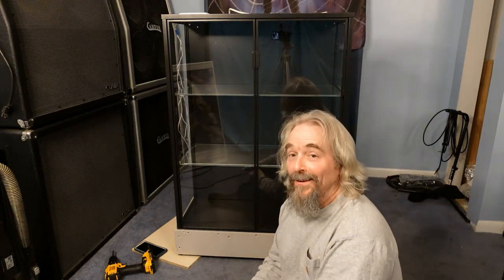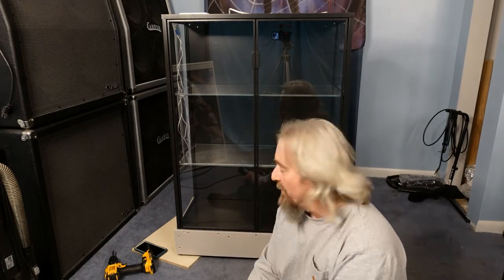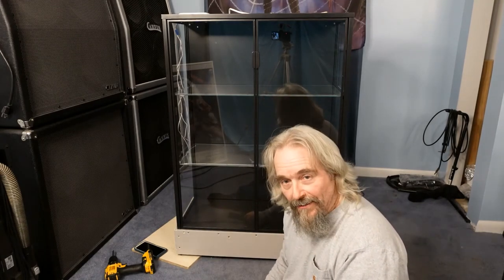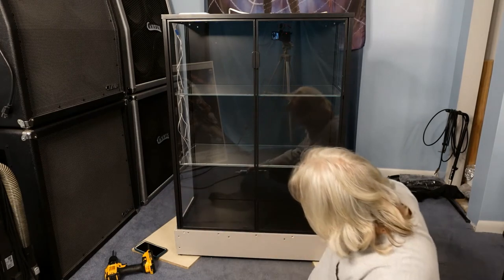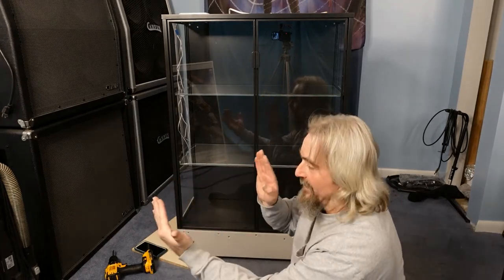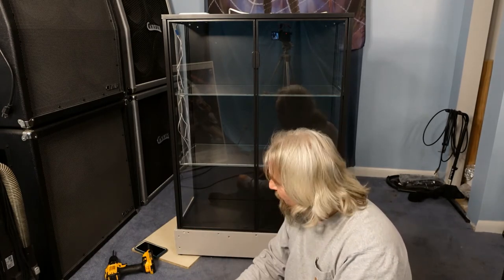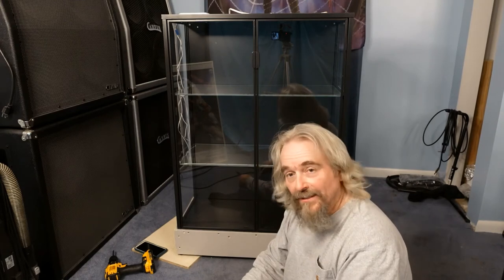All right. Whew, man, that was a workout. We got all the pieces in there. I had to go back and make some wonky cuts a little bit, because the legs were not all square. I think if I were to do it again, I'd probably avoid the 45 cuts, and I would make the front piece come all the way out to here, and then the side pieces would butt into it this way, and then the back piece would butt between the two side pieces. I think if I'd have done that, it'd have probably been better, because of the wonky legs. Trying to cut 45s like you would typically think you should do, with the legs all off, just made things a little hard.